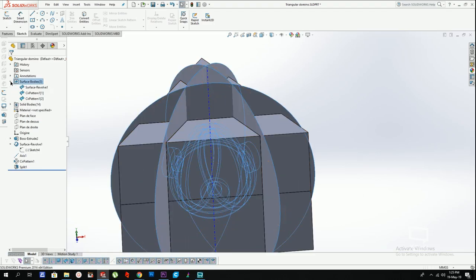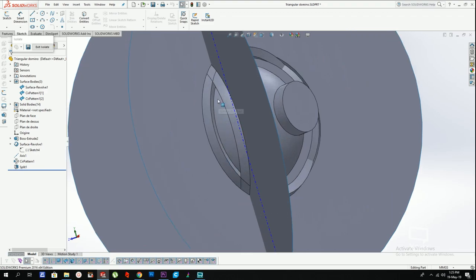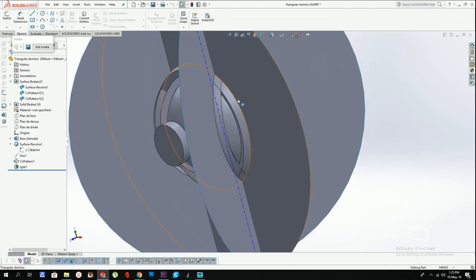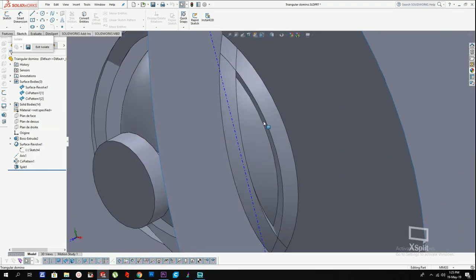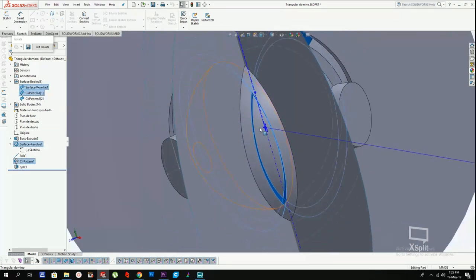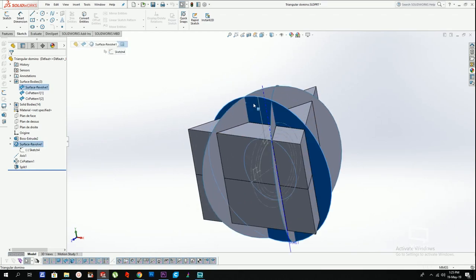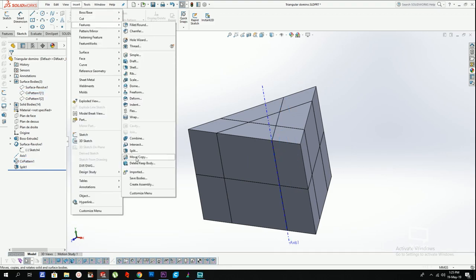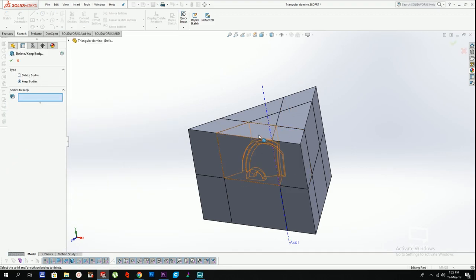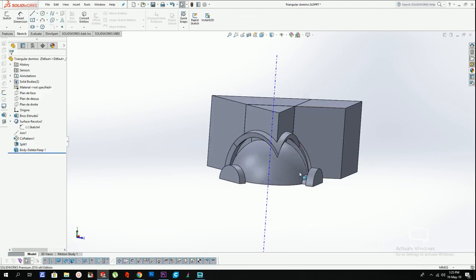That's because this was too far out. If I put three millimeters, there's going to be much more space for the mechanism, but that means my split function may have some unchecked boxes. Actually, I think I got lucky. If I look at the corner now, you'll see there is a mechanism — that's what we were looking for. Earlier the surfaces were so deep they were cut off — these two surfaces were too close to one another. Now I'm going to isolate certain components: keep those three bodies, remove the rest.